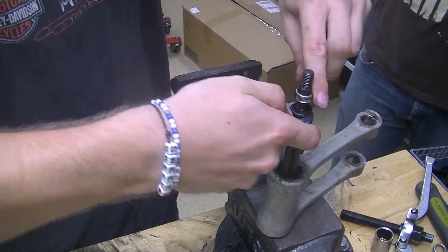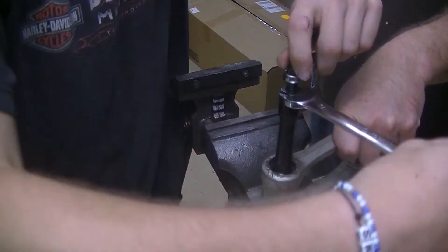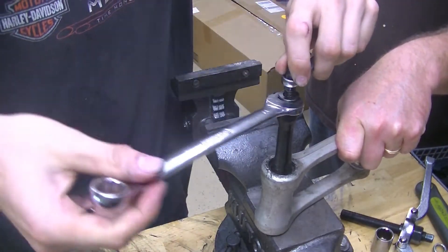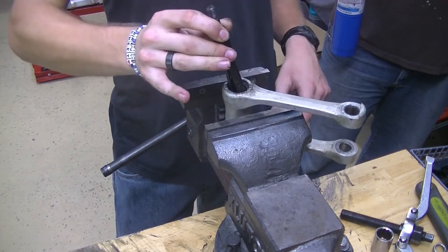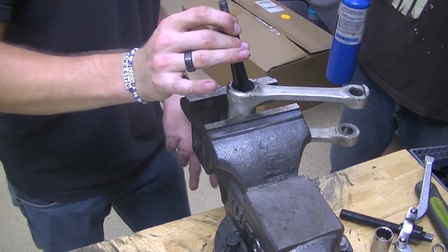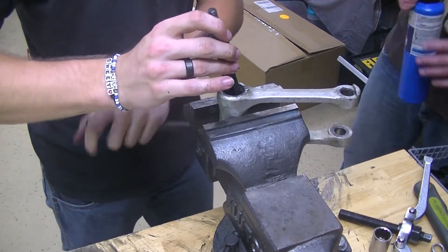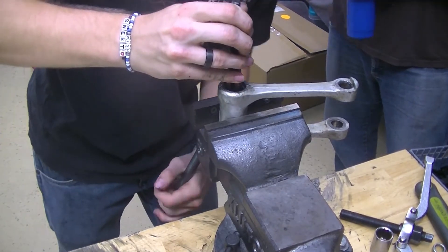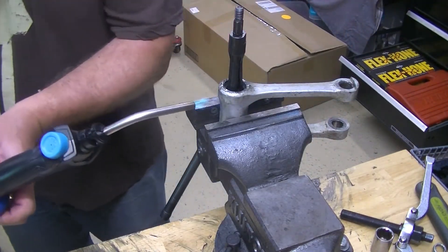I'm spinning this open in here because I want it to fill as much of this space as possible to keep it from breaking. If you're going to do this, you might want to take one of these legs and hook it underneath the edge of the vise to give you a little bit of extra security. You can use soft jaws, but they tend to slip too easily, and we're heating it up so we don't want to potentially burn it. Get that tightened up in there, and while he's heating it up, I'm going to set up the rest of the puller.